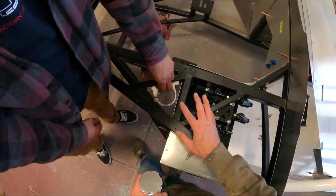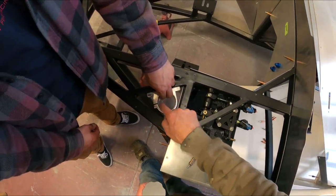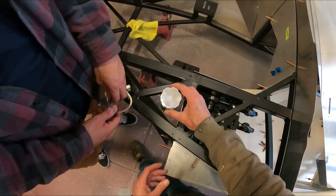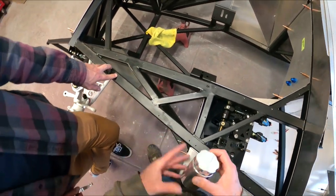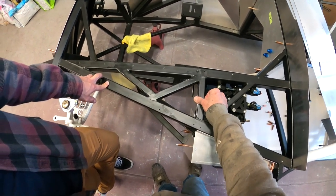I think we weld a couple of tabs. So what we're going to do is weld some tabs onto this bar and then we'll drill through here, probably cut these things off to clean it up a little bit. And this will be one into here. This other one, we've got to either mill or grind down and then same thing — weld some tabs, unless my son can come up with a better idea. But that was great because that way I can keep this aluminum like that.